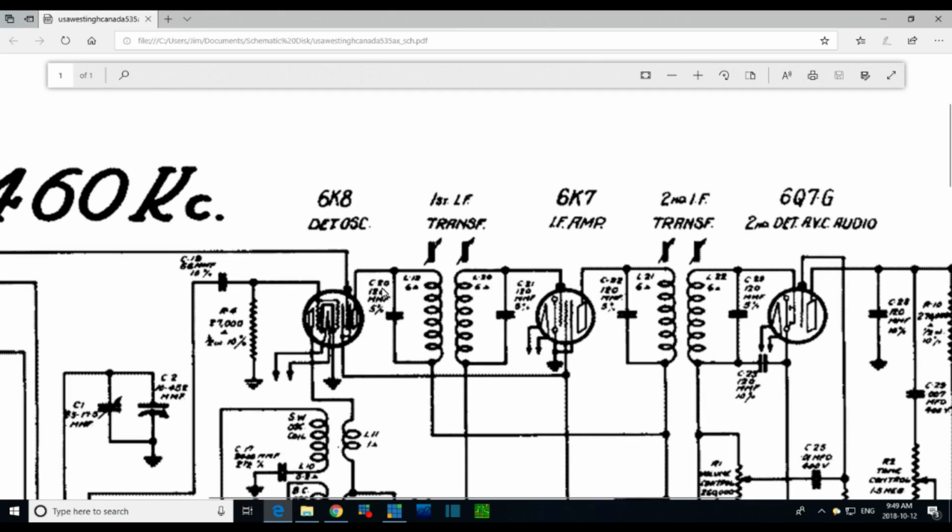Oh my gosh. So we're finding low voltage on the plate, which is on pin number 6, which is the plate of the triode. That's here. That's this guy. He's coming in low, what looks like low, at 78 volts. So he's getting his voltage from over here. Wait a minute. Hold on now. That's one of my meters saying goodbye. Well, this plate is hooked up to the same wire, basically.